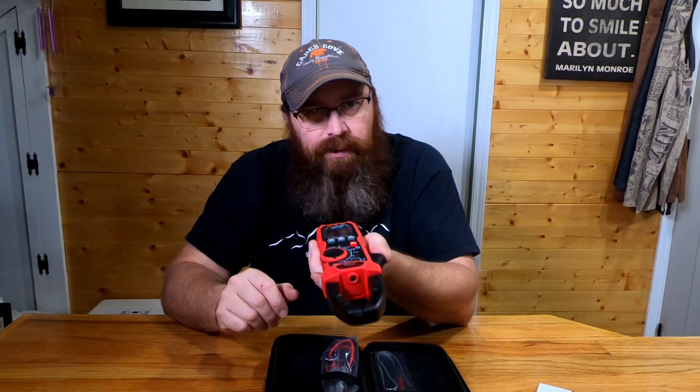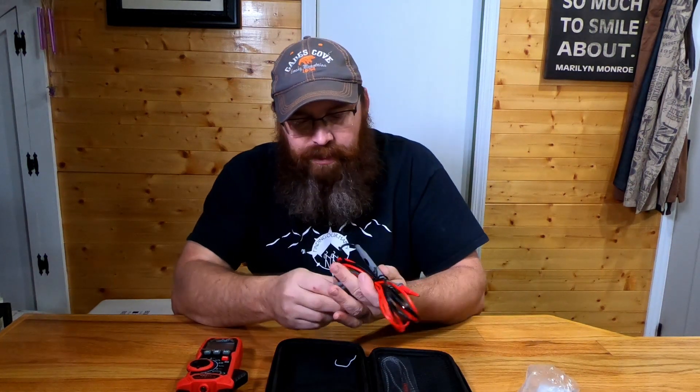This also has the NCV live setting — you spin the dial all the way down to NCV live and wave this probe near an electrical wire to determine whether it's got voltage on it. That's handy because it lets you confirm power is present on a receptacle you're about to work on, and after flipping the breaker you can come back and verify the power is off.